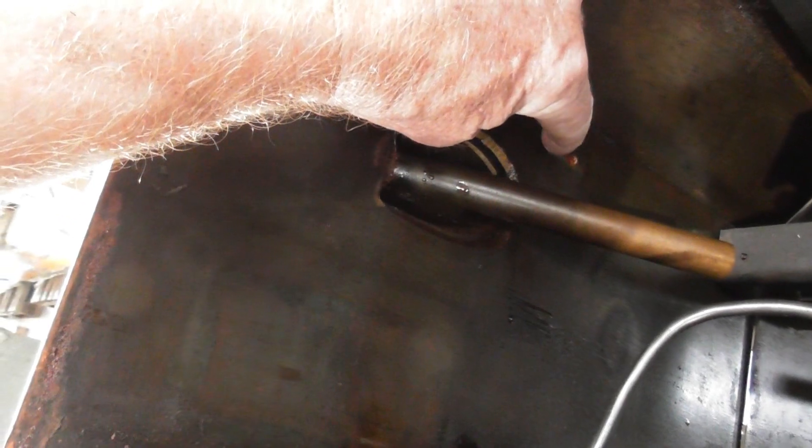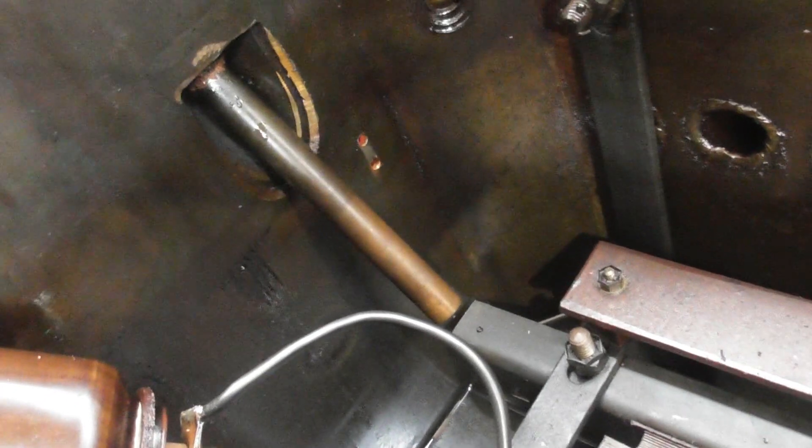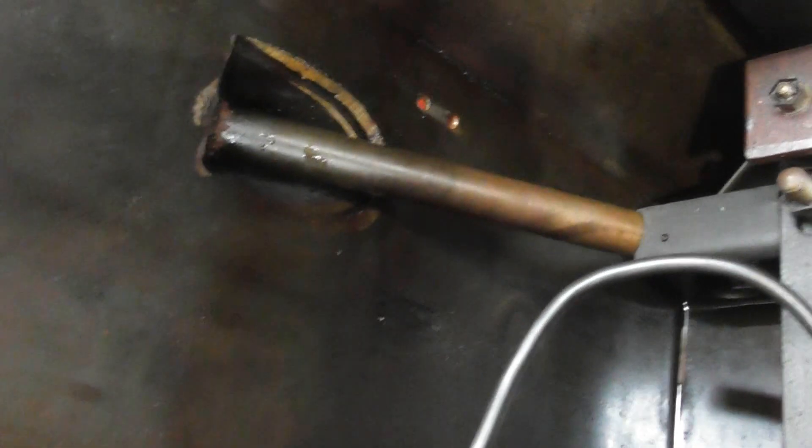The oil level gauge is here, so the oil should be more or less here. Oil has dropped down — probably about 12 centimetres below that. You stick your temperature gauge in here and that will give you the temperature reading if you want to do a local check.